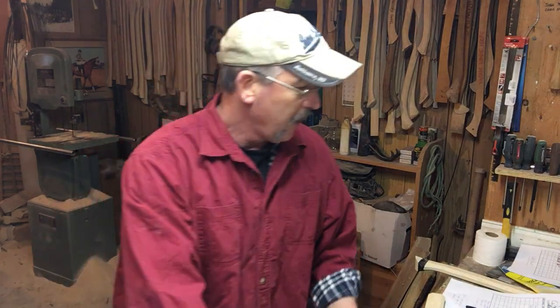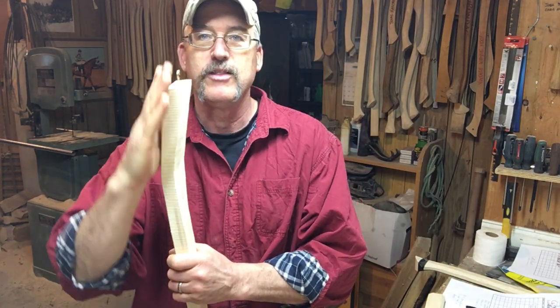The problem is, if that's how you secure your wood, finding wood, and typically if you want to make an offset handle, one for a hewing axe, typically you'll take that from the butt of the tree. Now when I'm securing my wood, typically what I do is I cut that first 16 inches off and leave it for firewood for the guy that's got the logs, because that puts that flare or that bend in the bottom of the handle. So of course for me and what I'm doing, primarily most of the time, they're not good. But every now and then I'll keep a few of those because they do come down and they get that same angled flare at the bottom, so your actual grain can come down and follow, as this one does, right along with the offset.